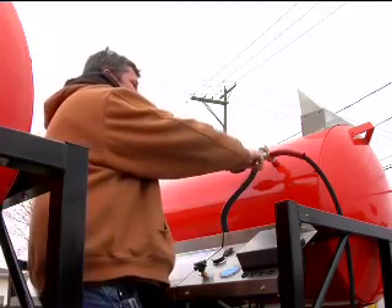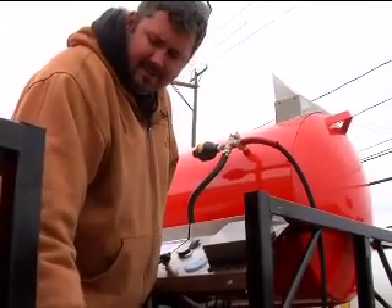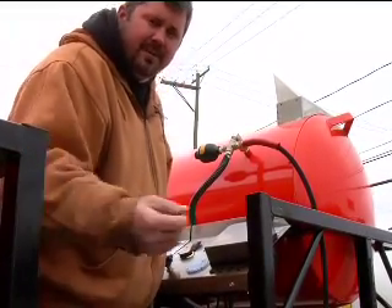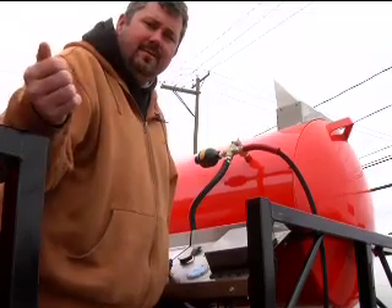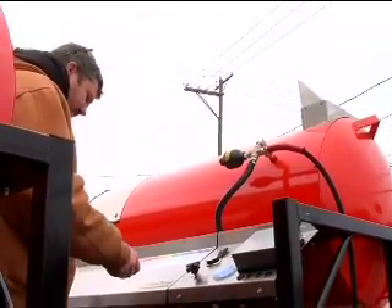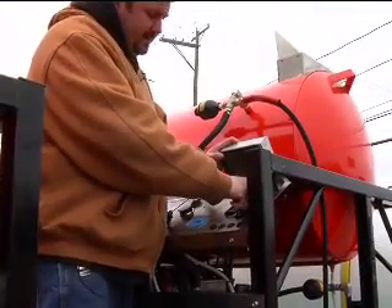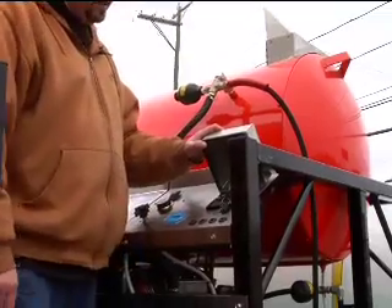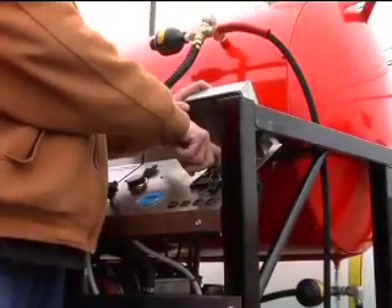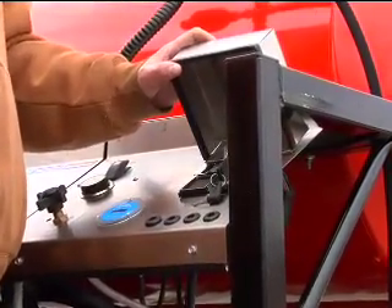You have your outlet to your hose reels — it comes off the machine, is fed down along the back with the rest of the hoses, and goes back to the hose reel. The front machine hose reel is on the right, the back machine hose reel is on the left. To start it, turn the key switch into the on position and wait — there's a glow plug light up here and you wait until that goes out, usually about 20 seconds.